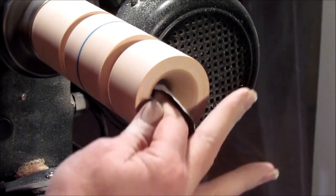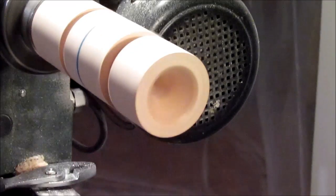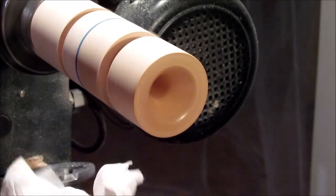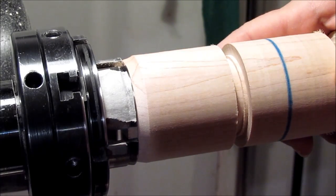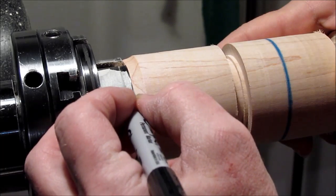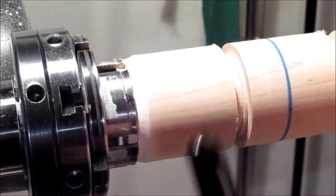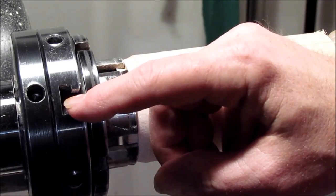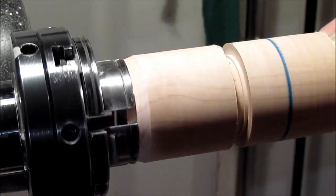I'm going to put a little bit of oil in here as well — I'm going to use some coconut oil because that's what I have on hand. I've done this eccentric style thing a few times so I seem to be working out a bit of a system. Now before I take this out of the chuck and start adjusting, I'm going to mark out my starting point. I'm not going to use jaw number one because the tooth at the very top of it is very thin and I don't want to bend it out of shape.